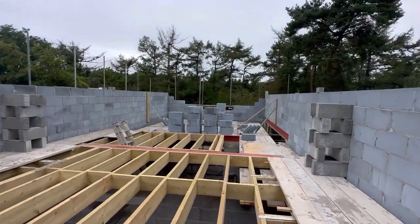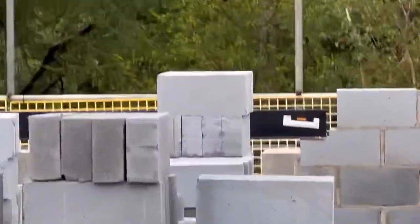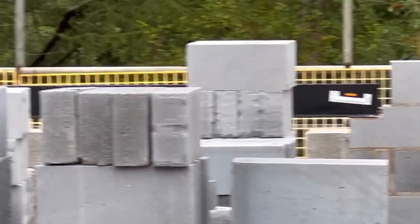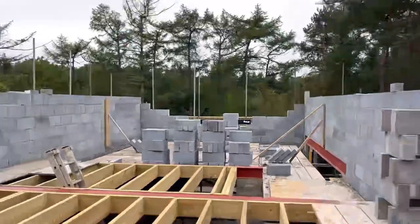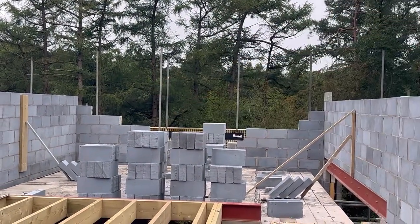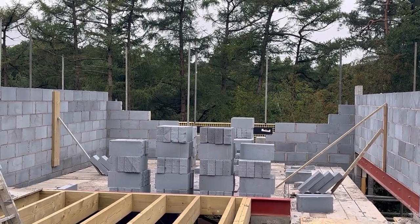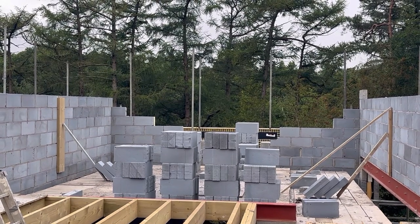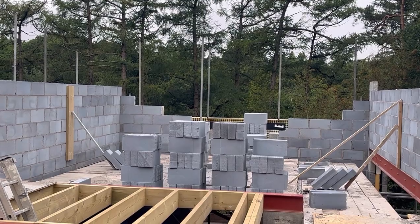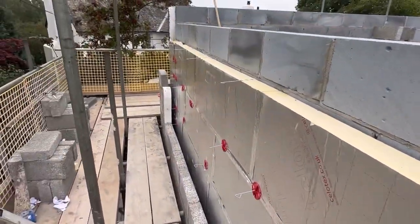I'll be over that side. You can see yesterday I put the lintel on. I've got to put a small cut to bring the lintel back to level, so I'll rip that down with a petrol cutter in a minute. And then I can send that block work through solid, because after that there's no windows on that gable. So now I can flip on the outside and then send the concrete block work through solid. So I'll get that sorted, Matt will get this end sorted, and then we'll see how we go.